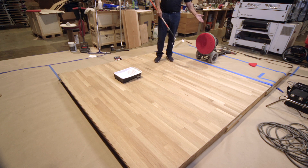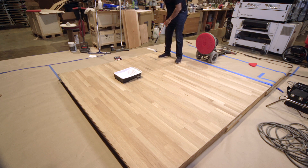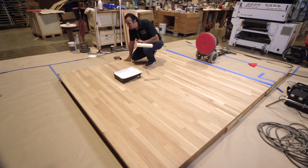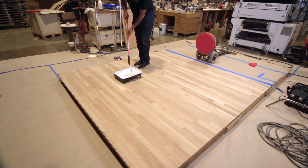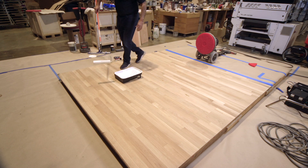Now, the best way to do this finish is to spread the oil. The easiest way I've found is to roll the oil on the floor without making a mess. I will do the perimeter first — so when I kneel on it and start working on the perimeter, I don't get dirty. I'll do the perimeter first and then roll the entire place. To do the perimeter, I'll use just a half-loaded roller so there's not a lot of extra work for the handwork.